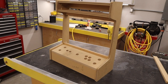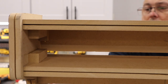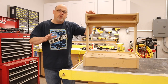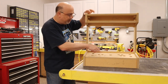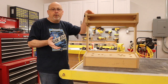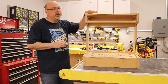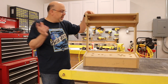The finished assembly is looking really nice. You can see here how the wall cleat will engage to the arcade and hold it to the wall. The next step is filling all the nail holes with some putty, caulking all the seams anywhere we butted two boards together, and then shooting it with primer. I have a full HVLP paint system, but on projects this size I'm just going to use a rattle can — I can do just as good work and there's nothing to clean up afterwards.